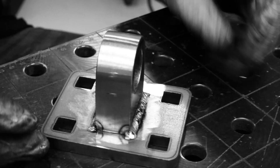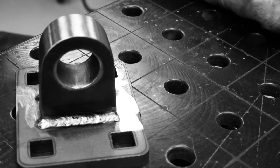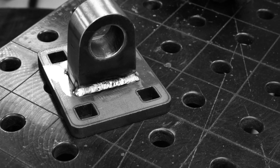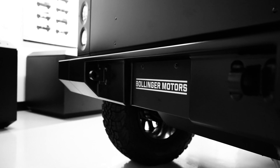And then if you look at the other side that wasn't prepped as well, you can see how it's dirtier and a little bit less consistent. It just kind of shows that the mill scale, if you don't grind it off, shows how much it affects a good weld as opposed to when it is ground off — and then it's nice.